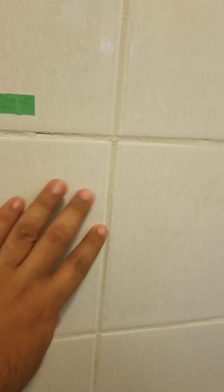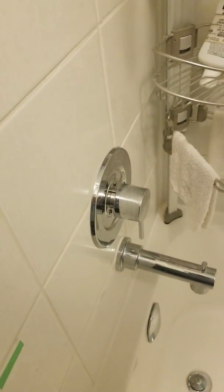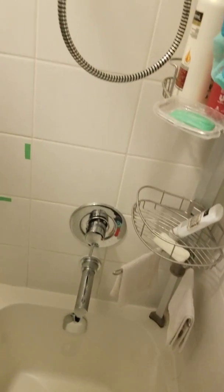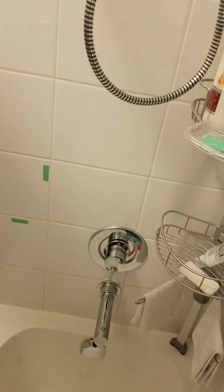They used sanded grout on all the bathrooms, and the grout is above the tiles in a lot of areas. There is a lot of grout on the surface of the tiles. And the shower head, the faucet, is off center. Mannick is trying to convince me that is within tolerance, and even the spout is on an angle, so the water will not fall directly in the tub.